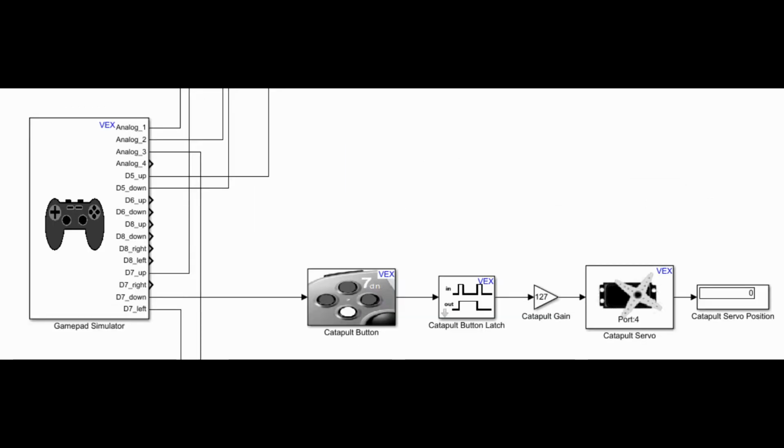The third subsystem is the catapult. This subsystem consists of just a servo that pulls a firing pin out of the holster that fires multiple balls at once. The hardest part about this program was that I had to work around the hardware, since if the firing pin was drawn out completely of its guide, it would not function properly and could not re-enter the holster. I simply had to readjust the degree that the servo would turn, but it still took a good amount of trial and error.